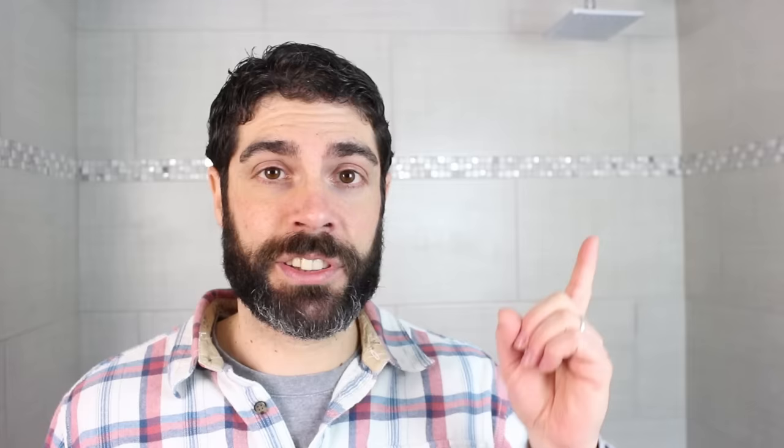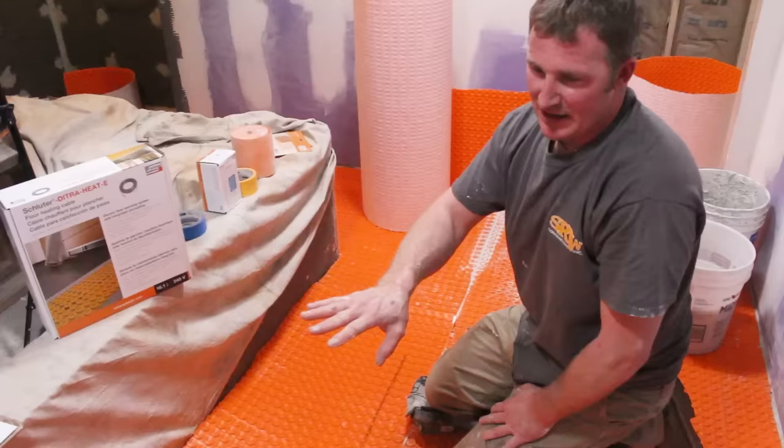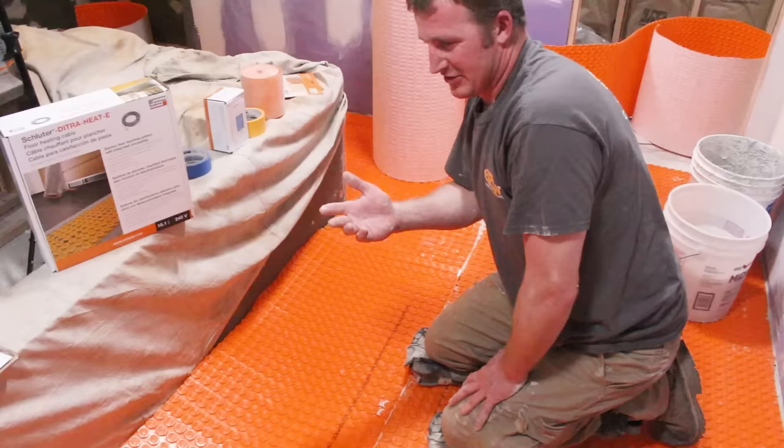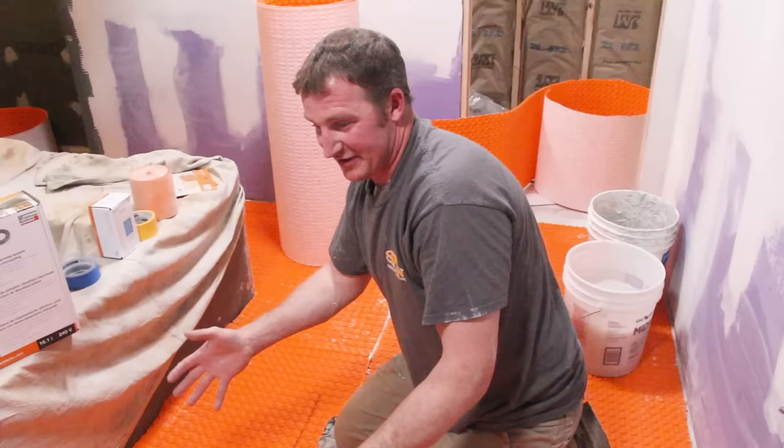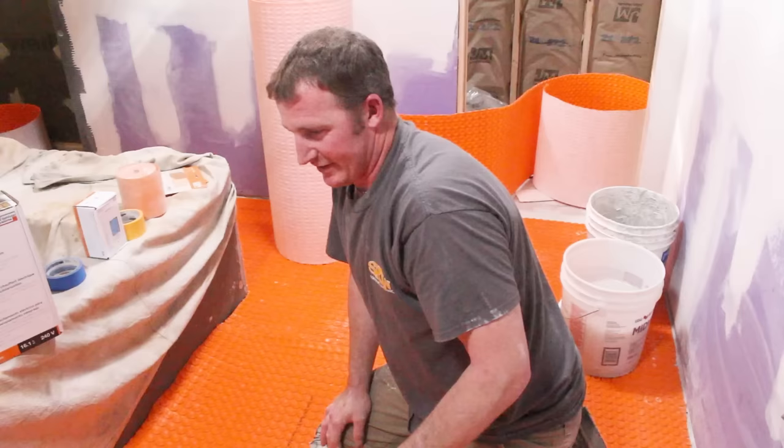As you've probably noticed, we're installing the DITRA Heat around the bathtub. I personally like to overcut a little bit so that when I embed this into the thinset, I can cut nicely against the wall to minimize any larger gaps at the edge of the floor. We're going to be doing KERDI-BAND around the perimeter of the floor. If you're a bit off on the edge, you can fill with thinset and be fine. If you overcut and do the details after it's set, it'll be easier.